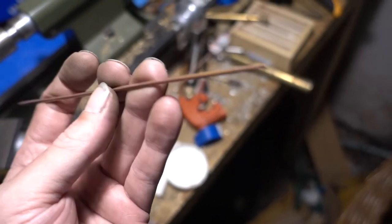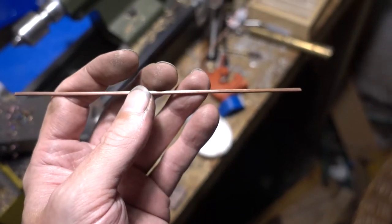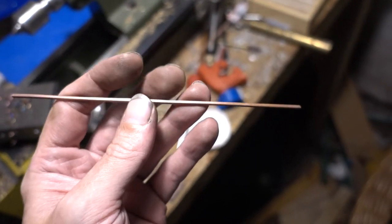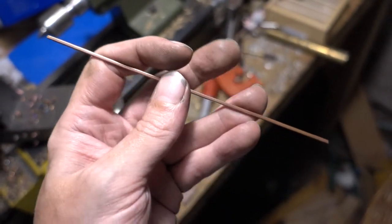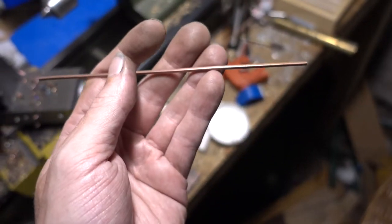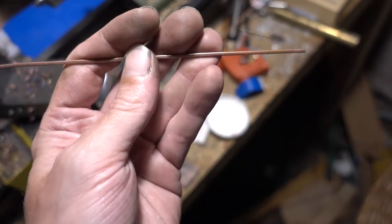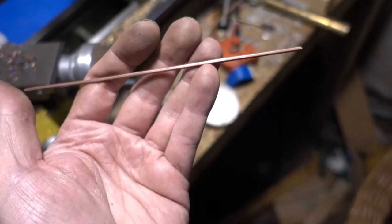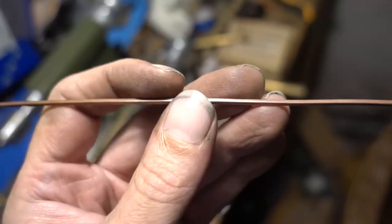So with that you will harden the material, and another important effect is that you basically dilute the mixed alpha phase, so that those crystals have a lower titanium content, which means that you increase the strength and also, which is a nice thing, increase the electric and the thermal conductivity of the material.